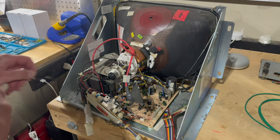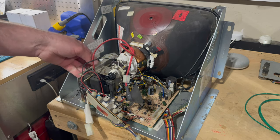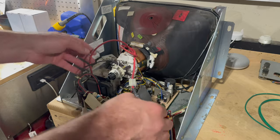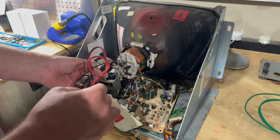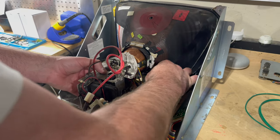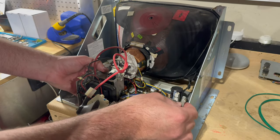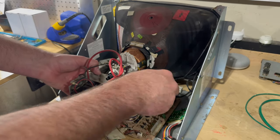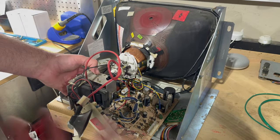And that's all, those two screws are really all that's holding the chassis in place. So you can just slide it on out here, but be careful because you are still connected and you don't want to get hung up on anything. And we can move it over to the side a little bit and give us a bit more clearance to come in and disconnect this two-pin degaussing circuit, which basically demagnetizes the tube,